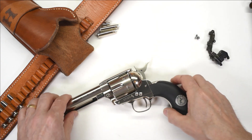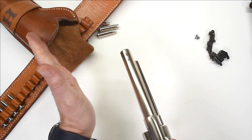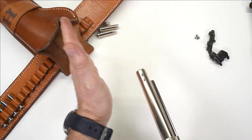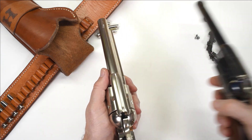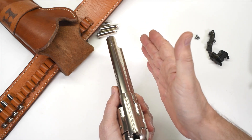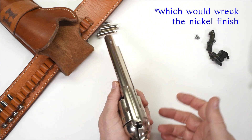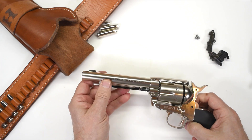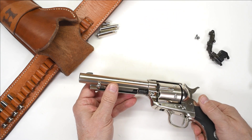Another problem I had with the gun — this is probably a little more serious — was that it shot to the left. Rather annoying, actually. If you were aiming at a pop can, it would hit off to the side of it consistently. I looked at the sights, which aren't adjustable — just a straight trough, which is correct for the type of gun. There's no way to adjust them. I did the math on it — even if you wanted to bend the sight or file the notch wider to bring the point of aim over, you'd have to do an awful lot. So I took the gun apart and looked at how the barrel sat inside the shroud, but couldn't see anything obviously wrong with it.